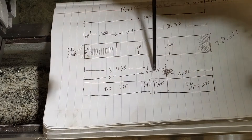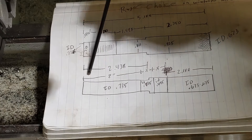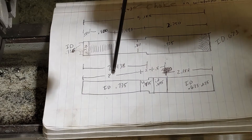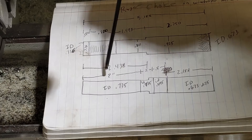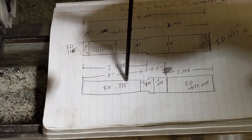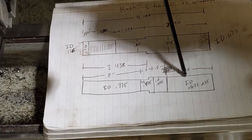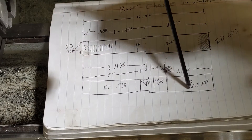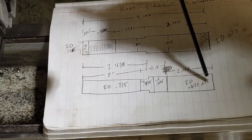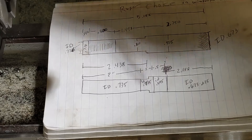Following my plan, I need to cut in 3 inches deep. My ID will be 695. So I'm going to make my first cut 3 inches deep and keep cutting until I get 695. Then I'm going to back off a half inch to 2.5 and cut to 715, then back off to 2 inches and cut to 735 — that'll give me my 3 steps. The idea is to catch the wadding, slow it down as the shot goes out the barrel, allowing the shot to settle and come out without the wadding. The shot will have a more uniform pattern striking the target, typically 30 yards away for a turkey shoot.